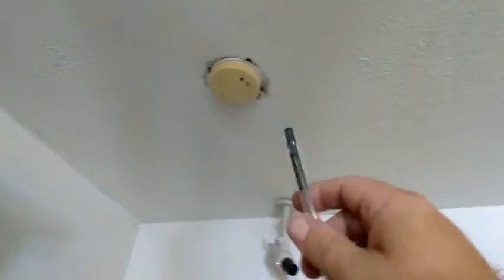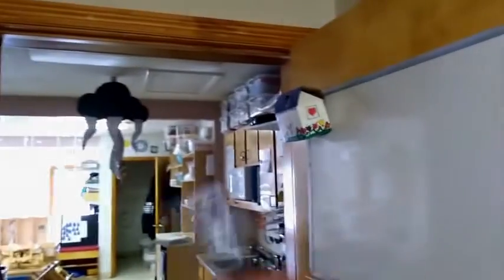Return here — we have a smoke detector and a light, so the return will probably have to come back down to here, putting it up toward the front of the building. Most likely we'll put two more returns. We have another smoke detector up here, so somewhere around the room perhaps. We have another access here, which is nice. Might even put the return over here, center right here — get it out of the way of the smoke detector. Same thing with the next class over, we'll probably tuck one in there too. This one will probably be a 16 by 25, and then these two will split up the equivalency of that.